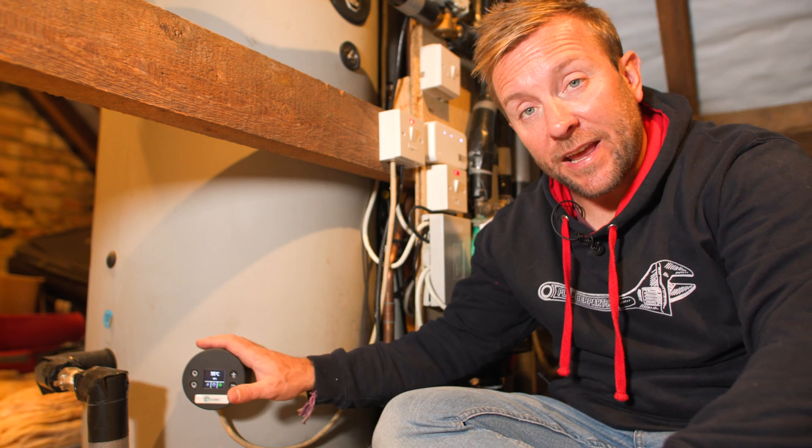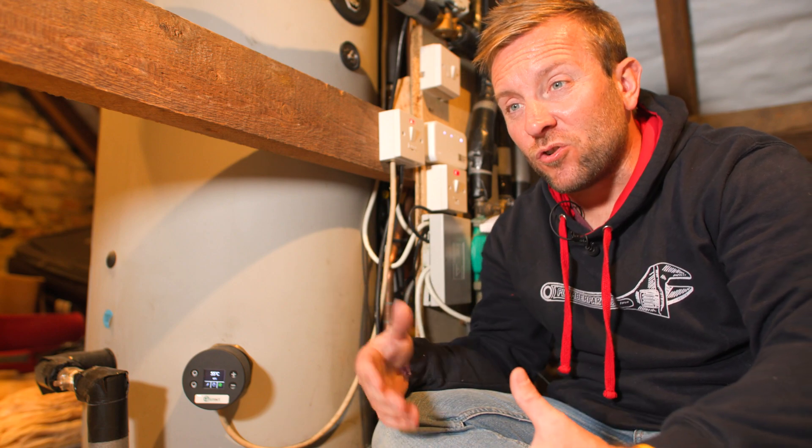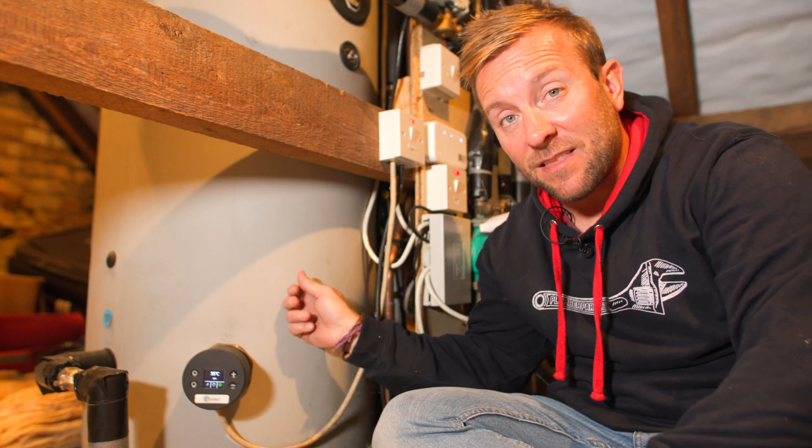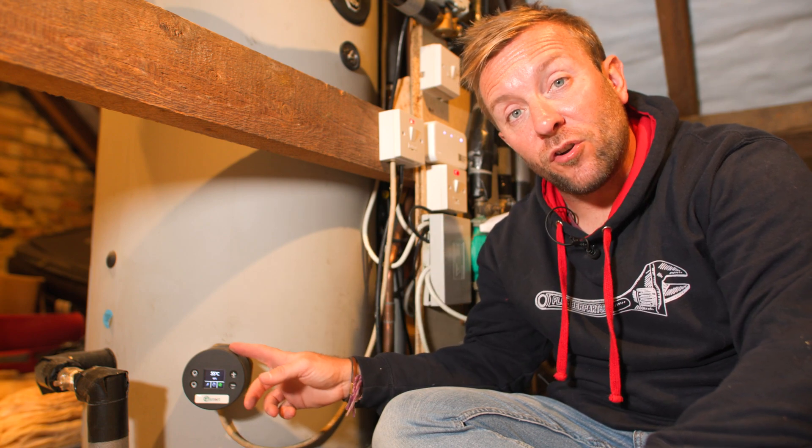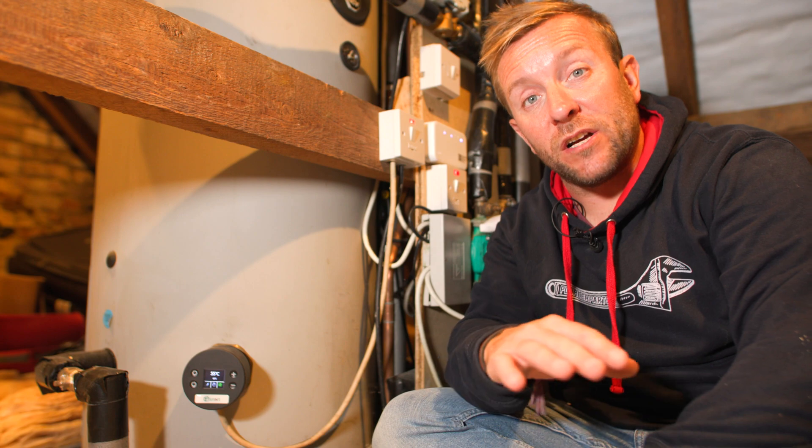I would use this immersion here as a backup. It does have a really handy little function that I love for when I go away on holiday. I can turn all my heating off and then set my heating to be frost protection for the rooms, but without a really unusual bit of equipment you're not going to be able to set this up for frost protection, especially when we're in the loft. This has got a holiday mode on it, so it just sets it down so it's got nice frost protection.